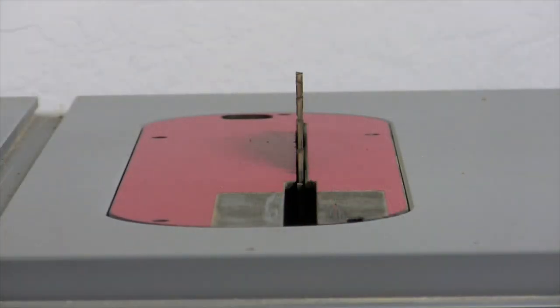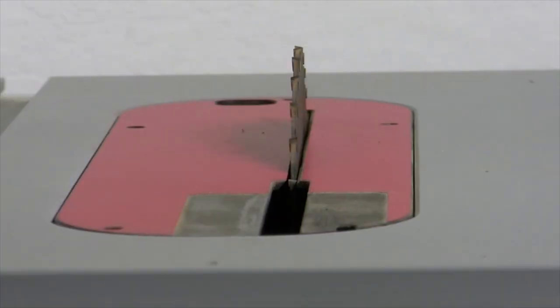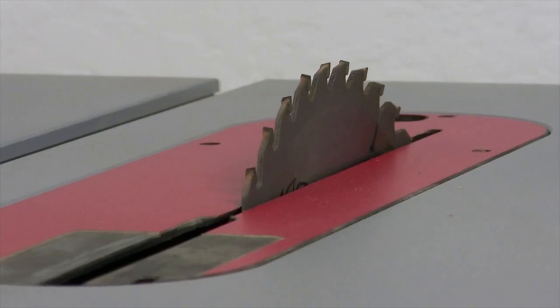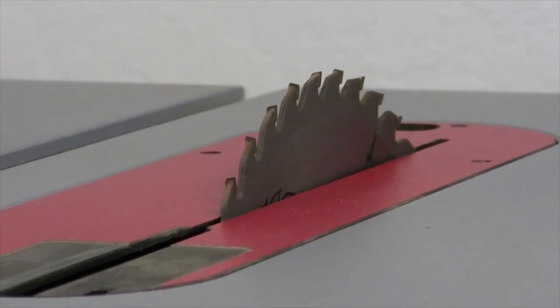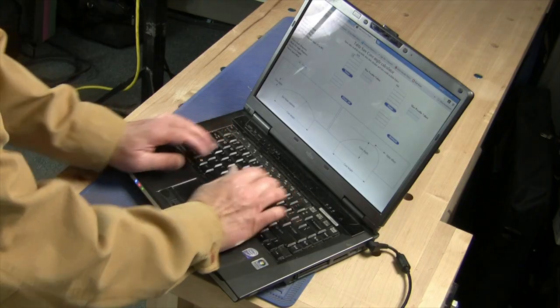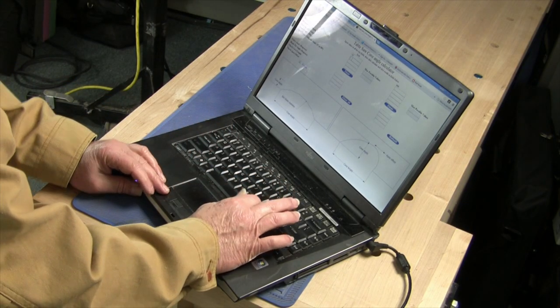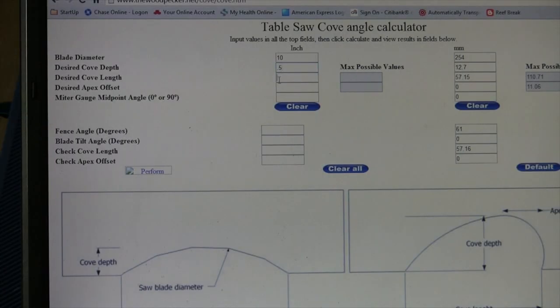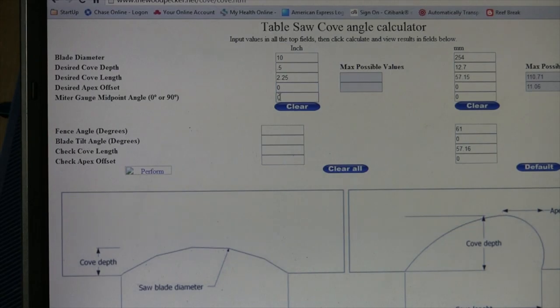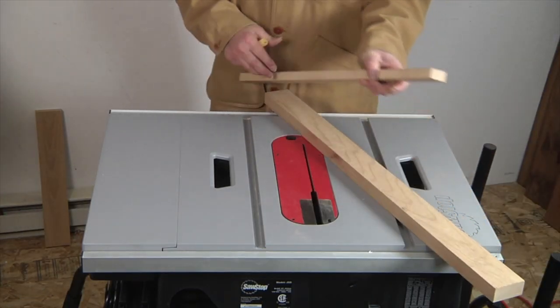Normally when we cut with the table saw blade, we're passing stock directly through the blade at a zero degree angle, leaving a narrow kerf. But when we start angling our fence and hitting the blade slightly sideways, we reveal the profile of the round blade, which gives us our nice cove shape. You can figure out the exact shape of the cove by trial and error or by using a chart available online, but I much prefer using a dedicated saw cove angle calculator. Here I'm entering my blade diameter, desired cove depth and length, and the amount of offset in case I want to create an irregular cove. When we press the action button, it generates our fence angle of 61 degrees.